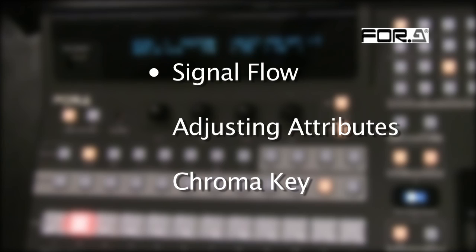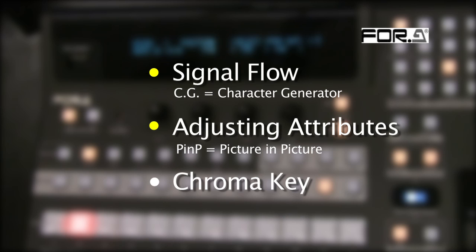Hi, I'm your host, Matt Hageman. You might remember me from training videos such as video lighting techniques and how to avoid a radiation cloud. There's nothing to fear. In fact, the switcher is actually really easy to learn. You just need to know what you're working with. I'm going to demystify the switcher by breaking down signal flow, which routes the CG and send signals from the switcher to the studio floor. Then, we're going to explore how to adjust the attributes in the switcher, such as the transparency of CGs and adding a border to the picture-in-picture. Finally, we're going to take our green screen lighting skills and put them to good use. You will see it is as simple as the push of a button and the turn of a dial to send your talent to not only China, Russia, or even the moon. All right, are you ready? Then let's hop on the Magic Aux bus. Next stop, signal flow.